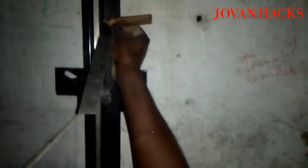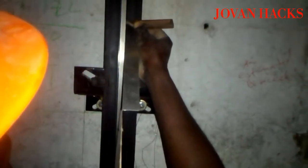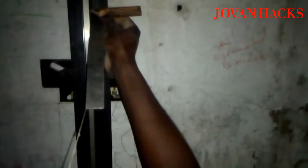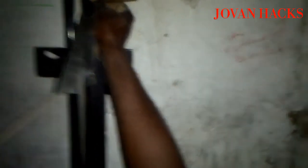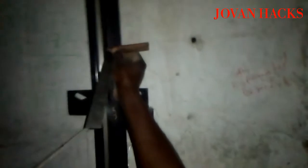You can see there is a string attached to the guide using magnets. We are testing for the squareness. It is placed on one side on both sides of the guide but on the same face. What he's doing now is testing for the squareness to remove the twist — the guides have to be facing each other perfectly.